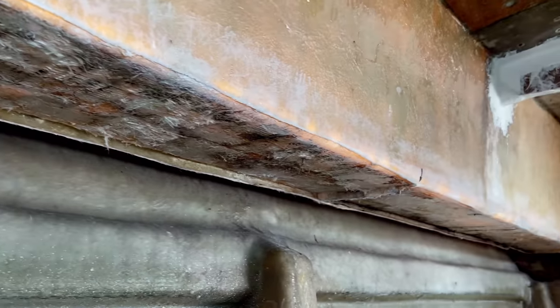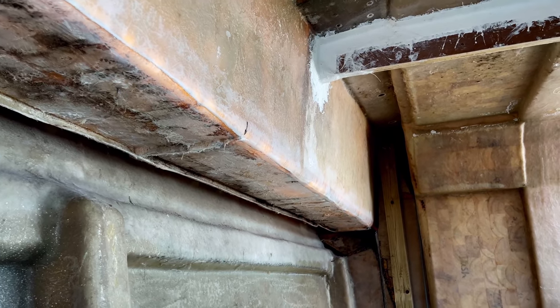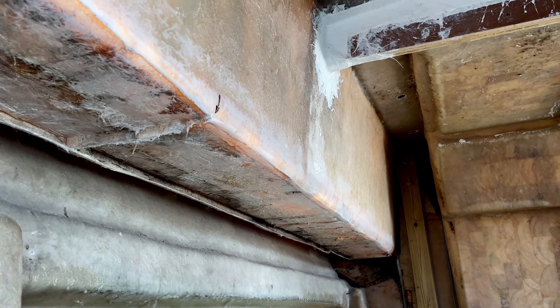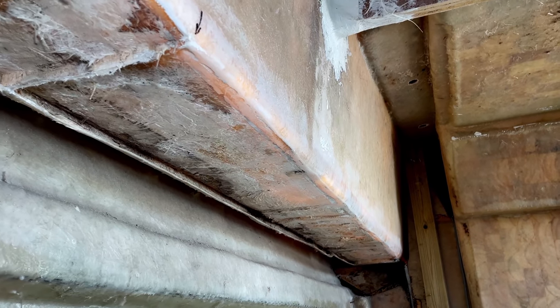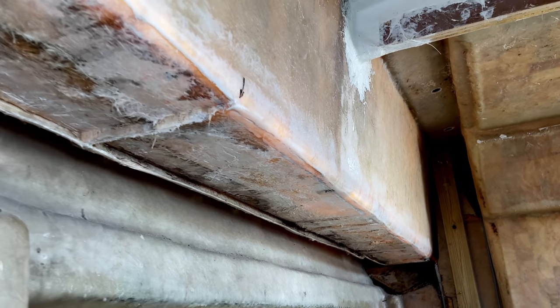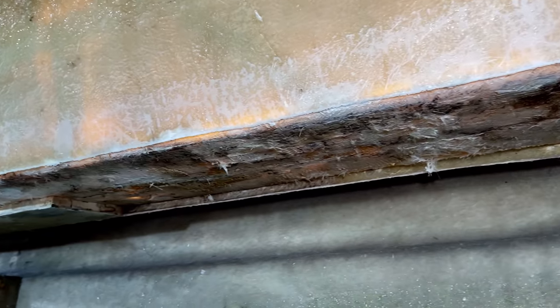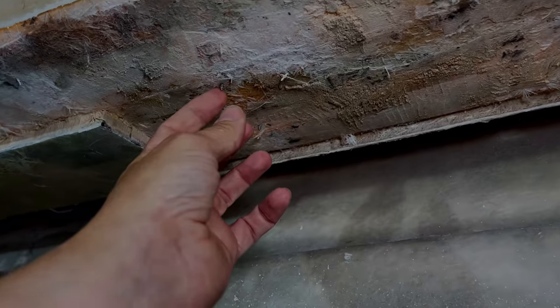I know that's a bit of a controversial move, gel coat on epoxy, but it has been proven on Boatworks Today to work. And these are going to be small minor spot repairs. So as long as the epoxy does its job and keeps the water out, that's all we're really concerned about, because we will be putting a teak deck on top anyway. But yeah, let's get these screws drawn out and get them drilled out.